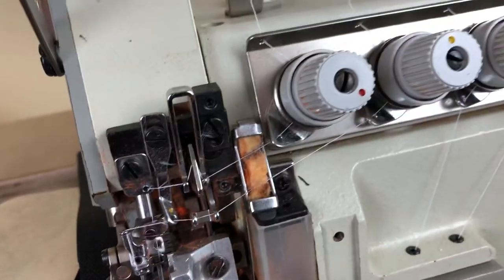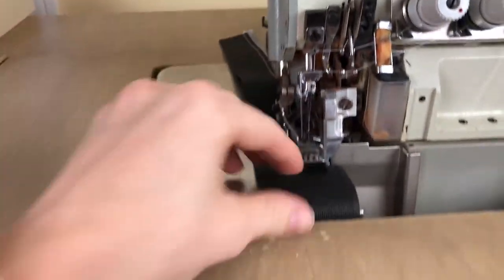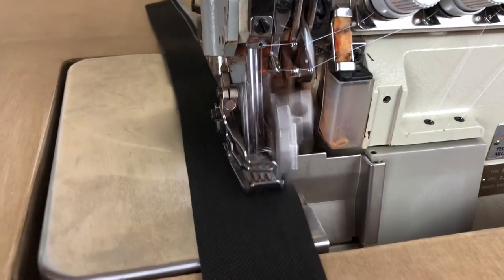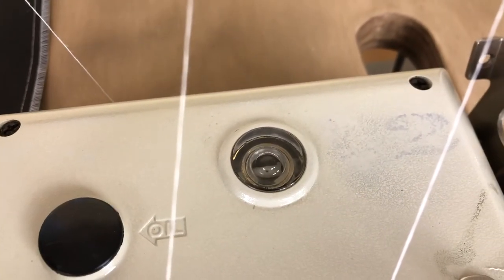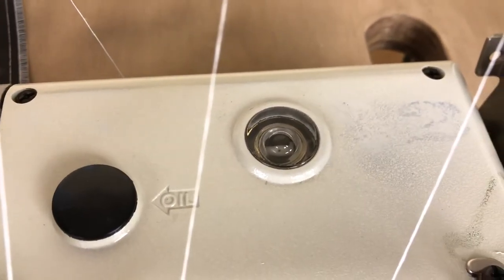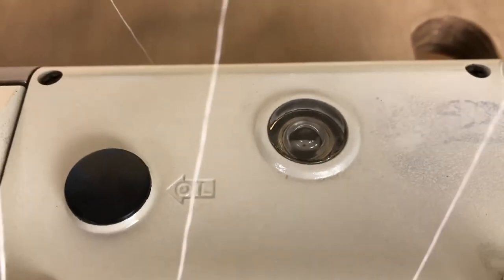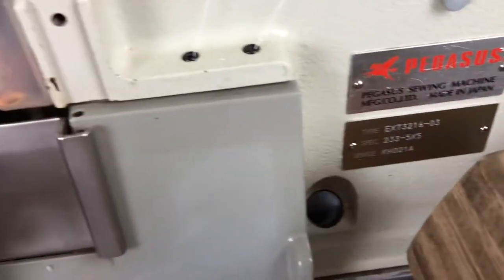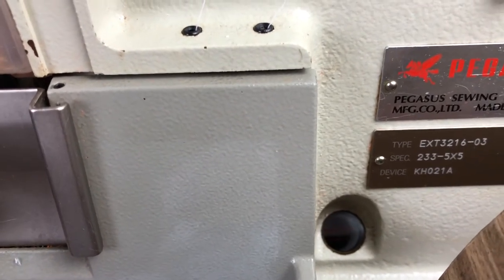Let me just run the machine for you. Another thing for the oil — you put it in here. You can see this little clear bubble; you need to see the oil splashing or bubbling in there when you're running the machine — that's what I read a few places. If you don't see oil in there, it's probably too low. To check the level of your oil, there's this little window here with two red lines, and you want your oil level to be in between them.